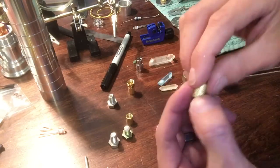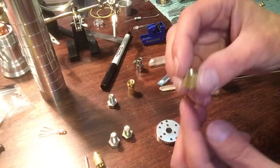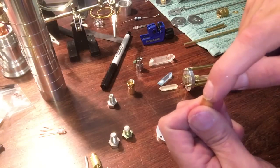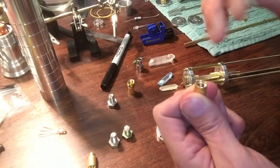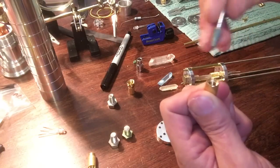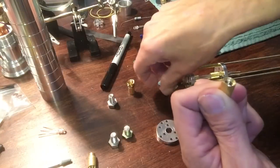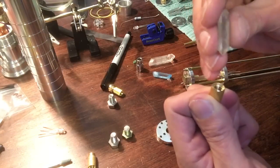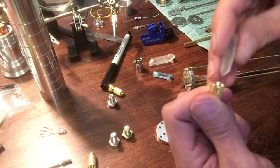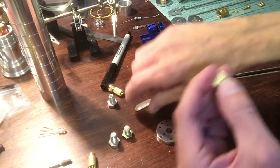Now on the other side, you're going to take another coaxial cable and cut this sleeve off, and you'll end up with something like this. This side is your machined side — you don't want to mess with that — but the other side where you've cut the sleeve off, this is where you're going to want your other crystal to fit through. You'll want to sand this off so it's not so rough, because your cutoff wheel on your Dremel will make that a little rough. You can also use that stone bit to carve the threads out a little and round it out nicer, just so your crystal will fit in. This is about a quarter inch crystal — they fit quite nice. I just buy a big bag; they come in multiple sizes and varieties and they're not too expensive — quartz crystals. That fits in there quite good.